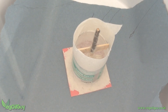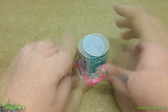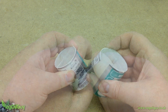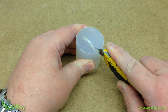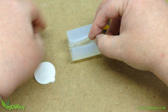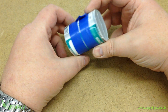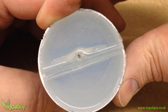The mould is then vacuumed again to pull out any air and pick up any extra detail on the coin. And here it is 24 hours later. The plasticine was pulled away from the plastic at the bottom. A sharp utility knife sliced the sealant tube and peeled the outer cover away. With a very sharp blade, this silicone was sliced through until the blade gently brushed against the sides of the coin. This opened the mould and allowed the 3D printed coin to be removed, leaving a perfect coin shaped void behind. I only sliced one side and left the other as a kind of hinge. The outer skin of the sealant tube can be added to the silicone with a little tape to provide extra support. Here's the hole where the sprue was.